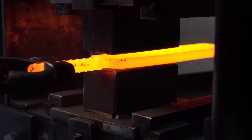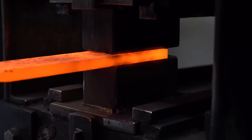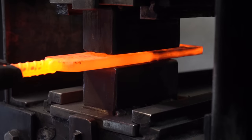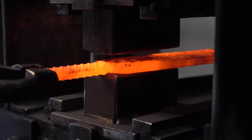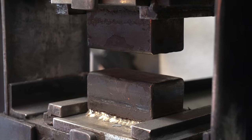There's no forge welding here so there's no need for flux — we didn't even have to get it up to forge welding temperatures. Here we're just getting it out of the forge and flattening it out. I don't really know why I had the dies in the long position here; they're much better the other way, so that's what I switched to.